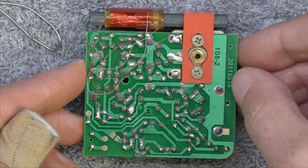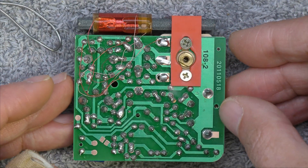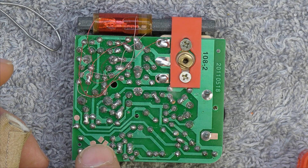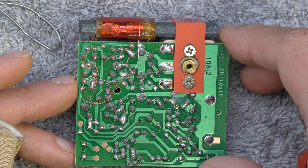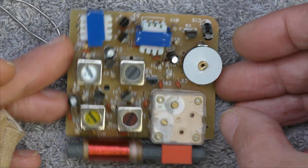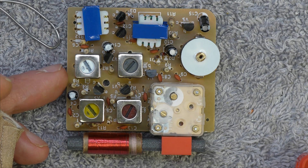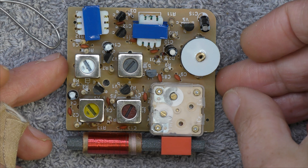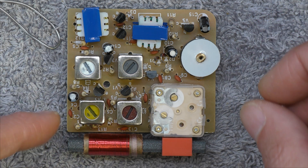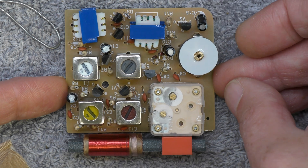Looking good. The directions are fairly clear. I've left the bias open so I can check what's going through the output stage - fairly easy build. I noticed the instructions refer to G and H versions of the RF transistor, one with lower gain for the converter, but I've just got all H versions. This one also has a couple of diodes used as a shunt regulator, so the RF stage runs off a shunt at about 1.4 volts - interesting to note.